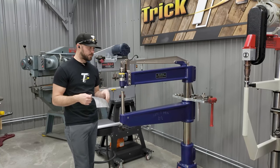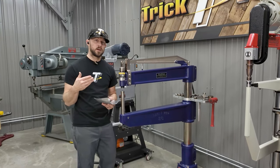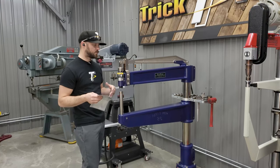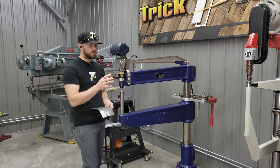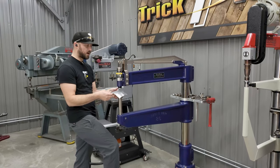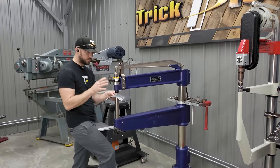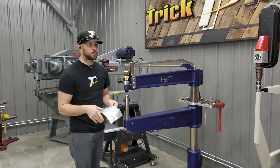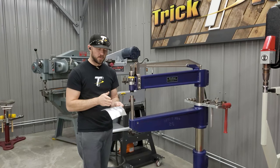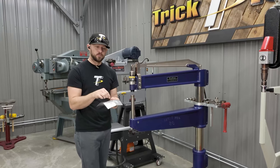With a planishing hammer you can do a lot of the similar types of panel shaping that you'd do on an English wheel. The difference is that on a planishing hammer you have the control aspect of being able to hammer in a single spot — when you push on the pedal you can move your part around just a little bit to hammer in one little spot, whereas on an English wheel the rolling action back and forth means you have to track over an area and it's a lot harder to get into fine-tuned really small spots.